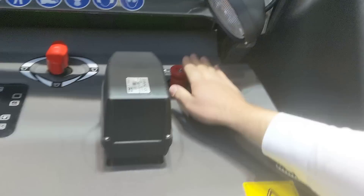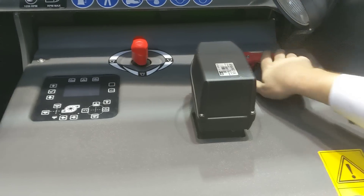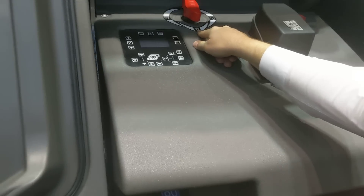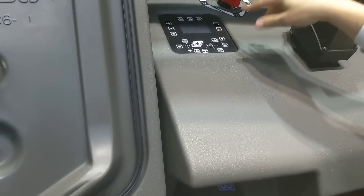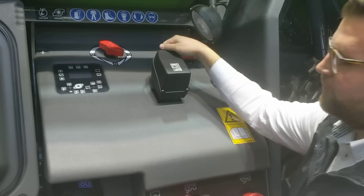This is the water hose at the back of the machine — that applies the pressure. The other red valve here is for the inductor. You can choose between different modes: this is the flushing system at the bottom, this is the cleaning system up here, and down here there's a little nozzle at the elbow — for fertilizer or something put in from back here, there's a nozzle to clean out the pipe. So if I had granular chemical, that would clean the granular out. And if you put the selector in between, you'll have both activated.